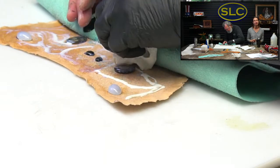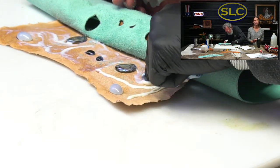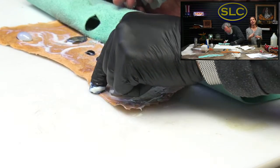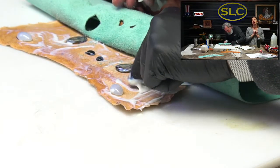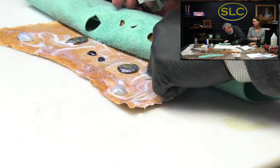Venting is important. It can also affect the lifetime of the bulb in your laser, the lens, all of those things. If you're not venting that soot out as you're engraving, it affects your machine. So it's just not good maintenance if you're not venting. That's my vent on venting. Ba-dum-bum.